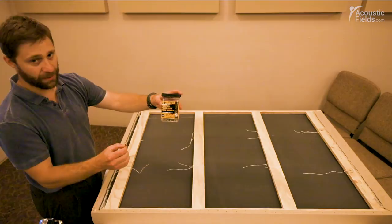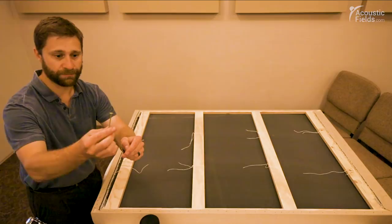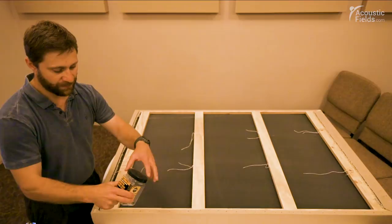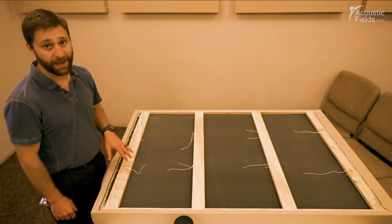It's a modified truss-head wood screw — a two-and-a-half inch wood screw with a nice flat head on it. That way, as you push it through the hole you drilled, it has a hook so it can hook on and won't slip off. That works good in case there's any vibrating or someone bumps it accidentally — it's not going to fall off the wall. Here in Alaska we get a lot of earthquakes, so there's a lot of shaking and vibrations, and this has been working for us really well.